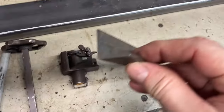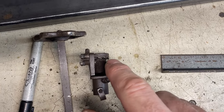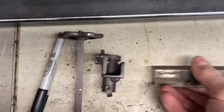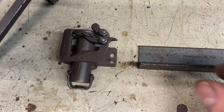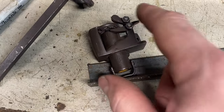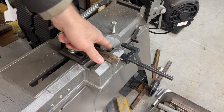I found a suitable piece of angle steel and noticed that this isn't exactly a square dimension - the bottom leg is longer than the top, so probably what I did is just cut that down to make room for this upper assembly. The other thing I noticed is that mounting bolt hole is a little bit hard to get to, and there's no reason why I can't make this a little wider. I like to cut the angle steel facing up like a pyramid because it's more stable and it allows the blade to go through two thicknesses all the way down.